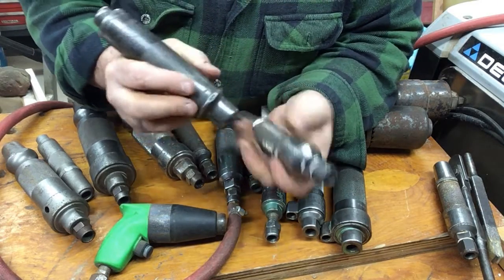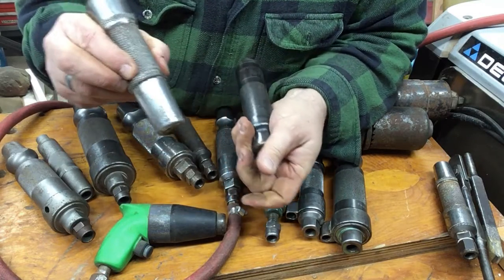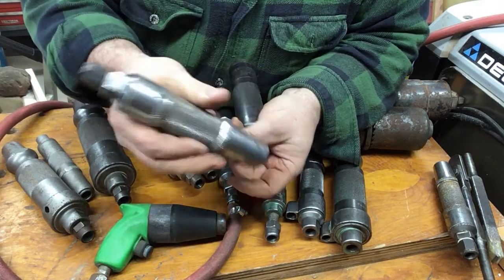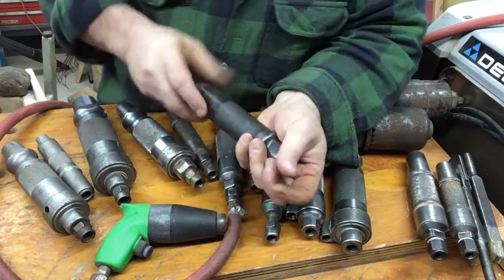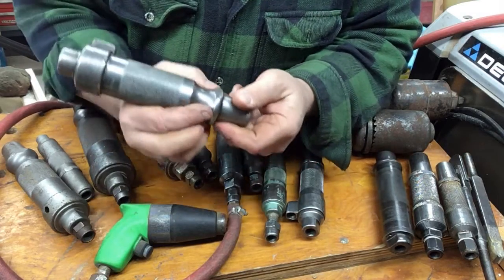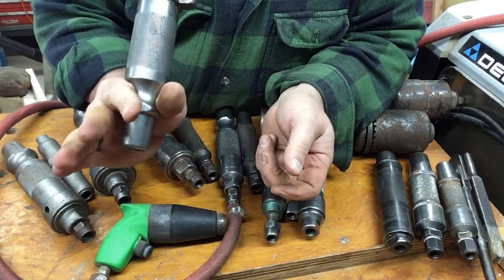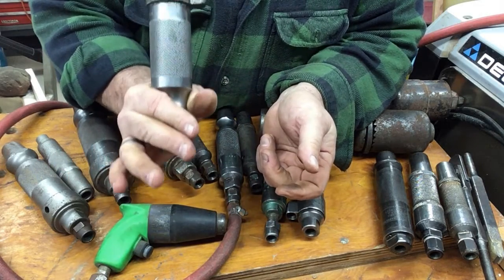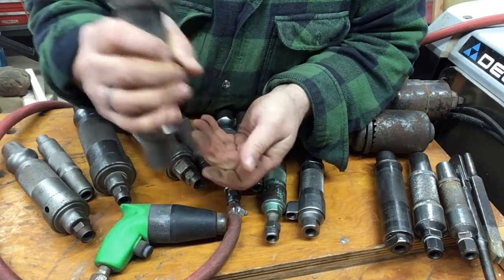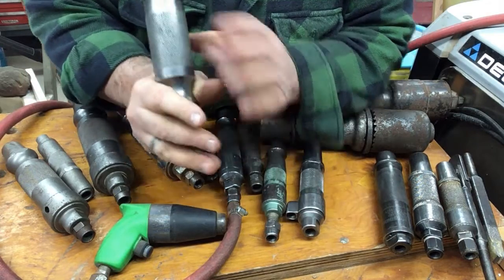That really wears your fingertips out — that's not how I hold it. With this early design there was nothing there, and if you hold it way back it doesn't make any sense for hard stones. But Barre superseded this with what they formally called the fingertip, where your fingers fit there very well. I still spend my time carving here — that's the least stressful way to hold the tool. You don't really squeeze it hard with your fist except for rough work. For carving, I carve everything like this, and it's the least amount of stress on my hand.